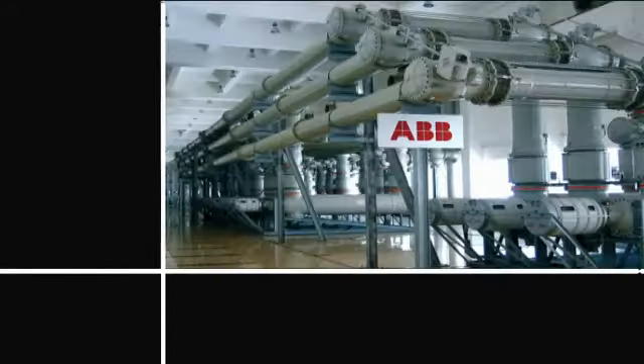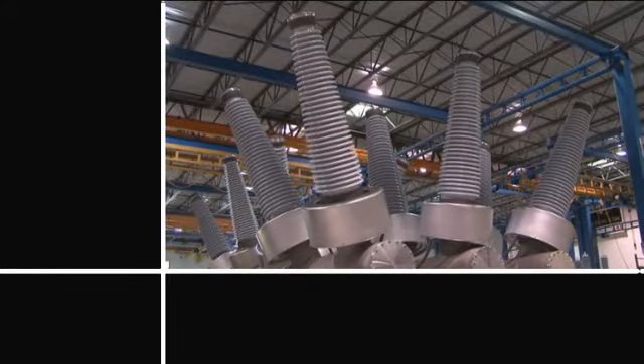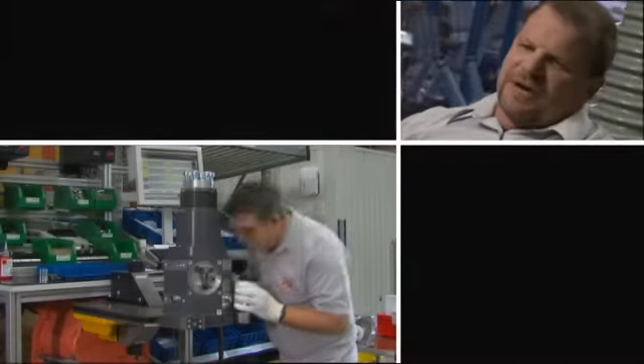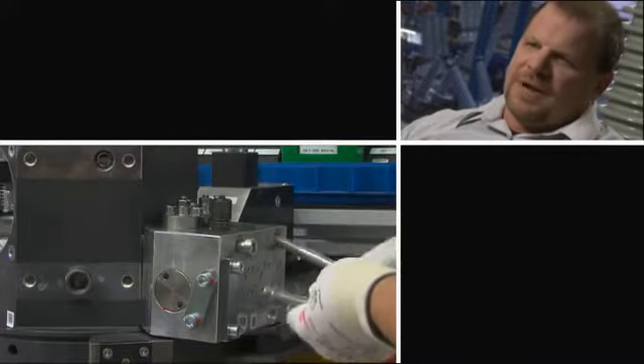The HMB mechanism is exclusively used on our gas-insulated switchgear for high voltage. We use it on our dead tank breaker products and in live tank breakers. One of the most important places it's used is in generator circuit breakers in nuclear power plants.